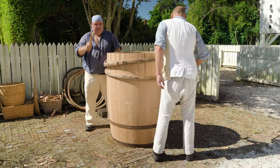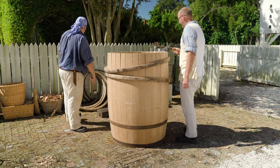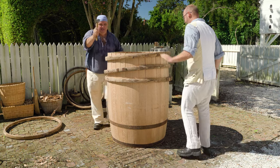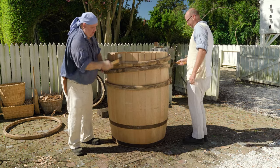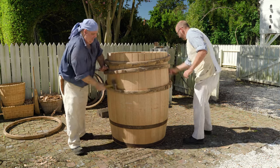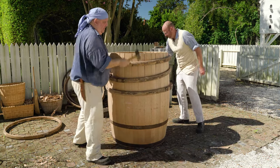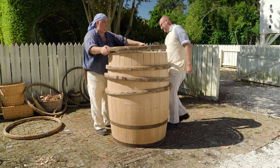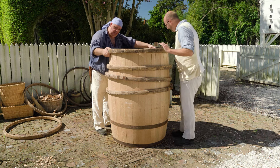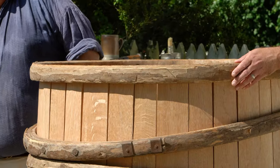We'll drive the overrunner back down on one side at a slight angle. Although that gives the end of the container a slightly oval shape, it actually makes the overall circumference at the open end a little bit less than the circumference at the middle. That lets us catch a slightly smaller hoop over the end of the container, and we just keep repeating that with a series of gradually smaller and smaller hoops until it's pulled all the way together.